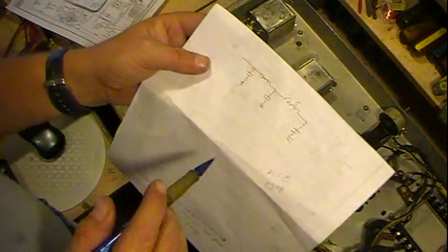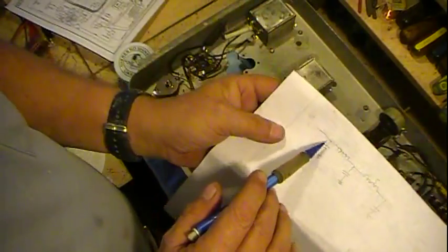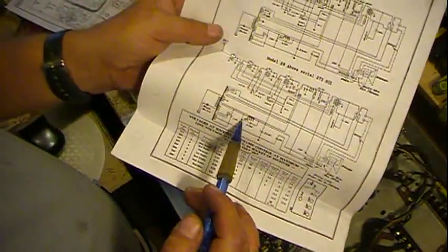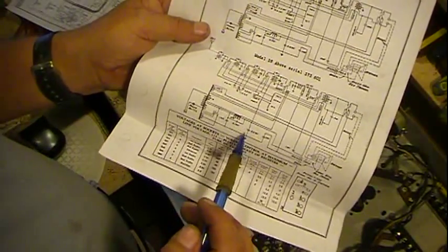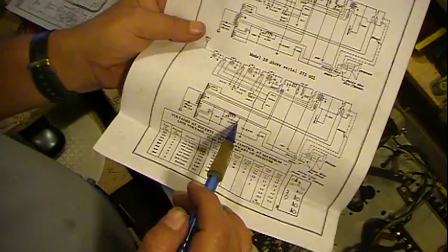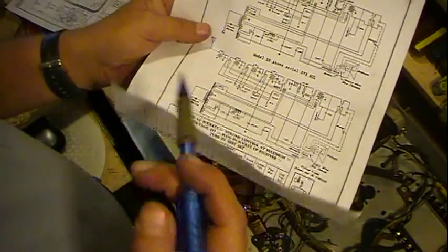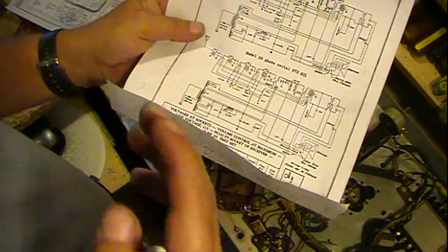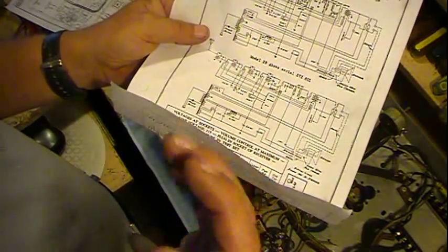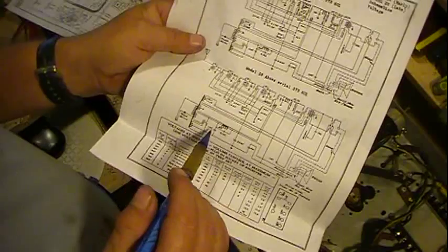So really what that is, is something like this. This is coming from the rectifier. This is that first pi filter that I showed you. This one right here. Don't get confused by how they're running these two caps. What this little cap here is for is that it's a coil and it charges up a little bit. It's got ripple through it, so it'll charge up a little bit and have a little bit of discharge on it. It could spike, and they put that 0.1 there to stop that spike. That's all that's there for.